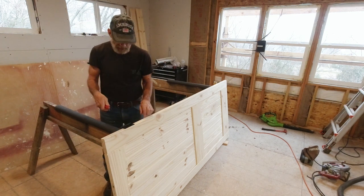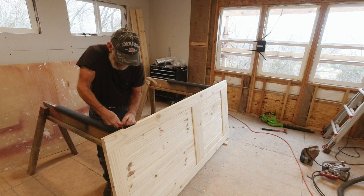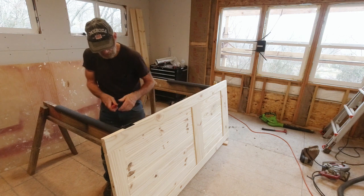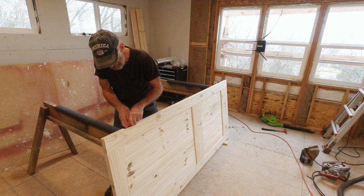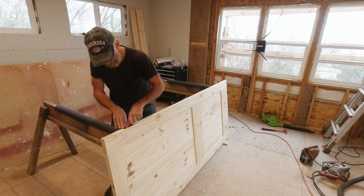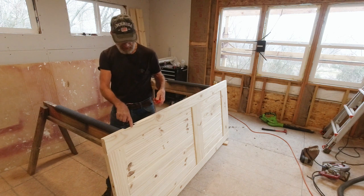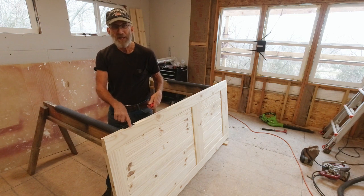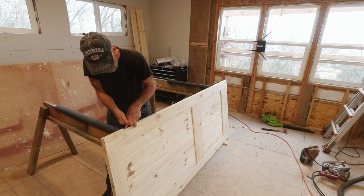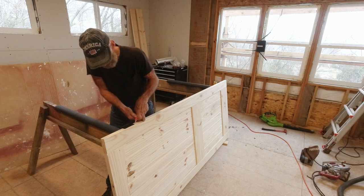I'll use a sharp utility knife to actually mark the placement of the hinges. That keeps the wood from splintering above, below, and around. That's especially important on the edge — you've really only got about an eighth of an inch of meat to keep on this edge. When the door is closed you wouldn't see it because it'd be hidden behind the doorstop, but when you open the door it'll look sloppy if you can see the edge of the hinge. I'll score three or four times, try to get it as deep as possible so that I don't blow out this edge.